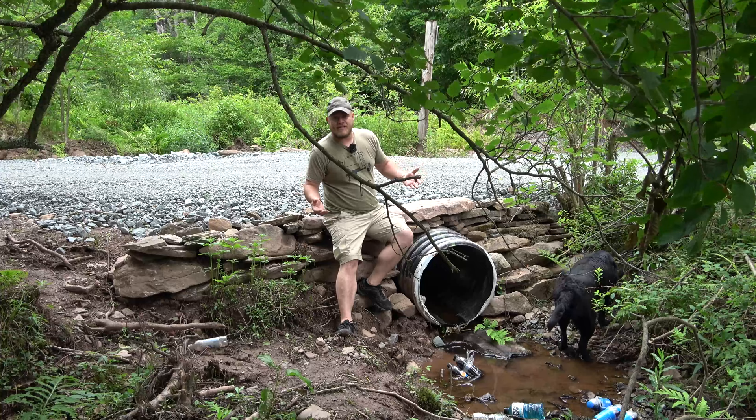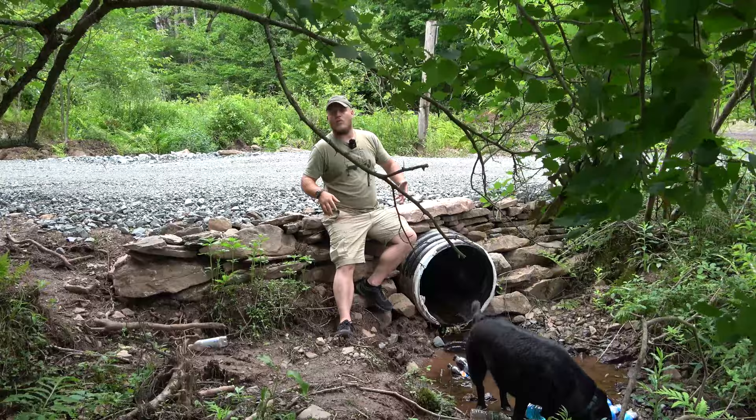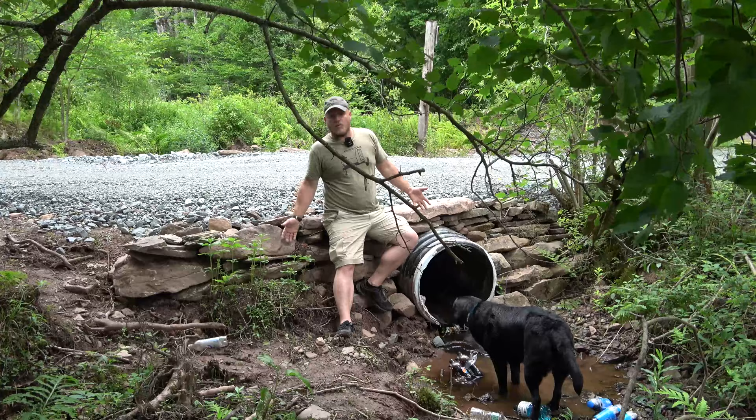Every section where there was a springway, a stream, or a wet spot where we needed to drive the equipment, we had to traverse with culvert pipes and put in large headwalls and tailwalls. Even though the water is flowing really low now, when the snow is melting out this is a raging river, so these giant walls help hold the pipe in when they're flowing at full capacity. That's why I was gone for the whole month of June.